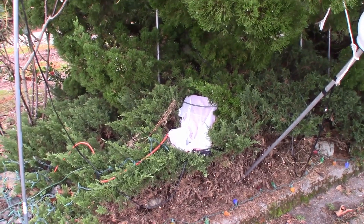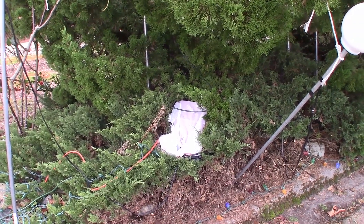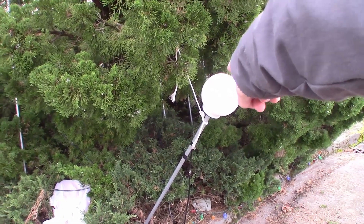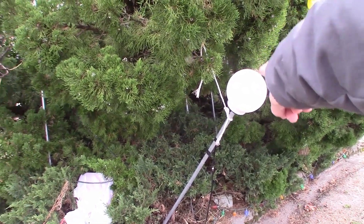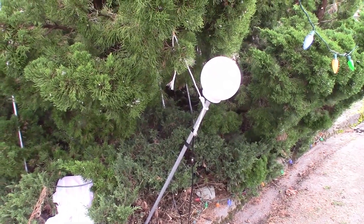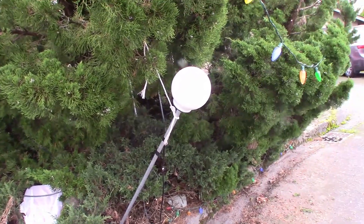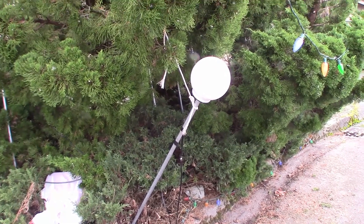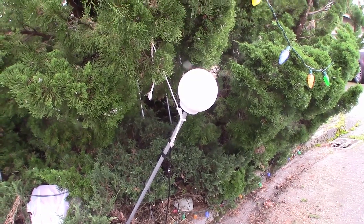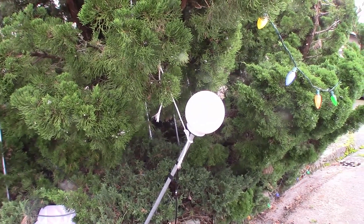The reason I run it on 12 volts rather than 5 is that I don't have to worry about voltage loss. Some globes are really close and would have very little voltage loss, but another one is probably 25 feet up the tree and would have considerably more. By putting a 12-volt to 5-volt converter in each one, I end up with 5 volts at every globe. I also probably could have used smaller wires, but that's what I had — so that is the globe design.